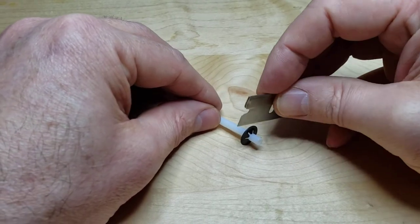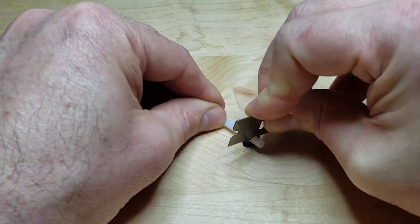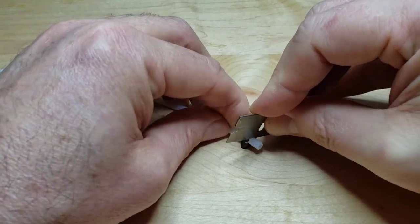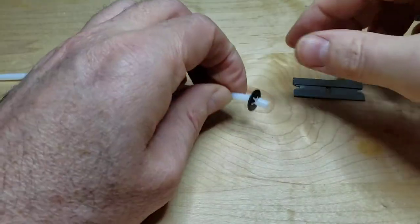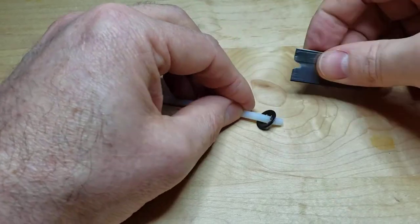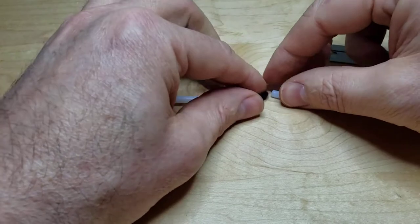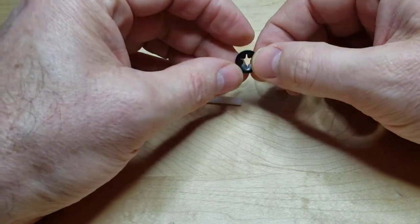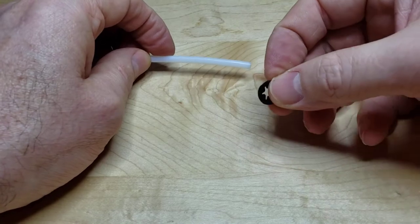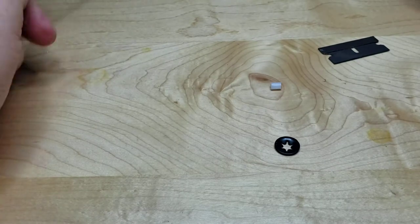What you do is get one of these little straight razors and just cut it off right up close. Almost too close. Kind of feed it in a little bit, just like so. There it is — see, it just kind of fell off. I still got a little bit on there. There we go. So that's how you can totally salvage one of these little snap rings. If you're ordering a new PTFE tube and want to salvage the snap ring off your old one, that's how you do it — get a straight razor and cut it off. Boom, it's off.